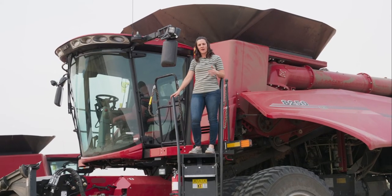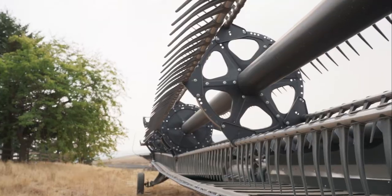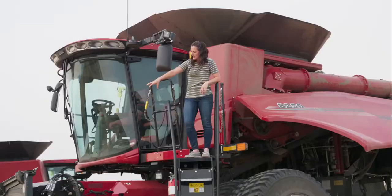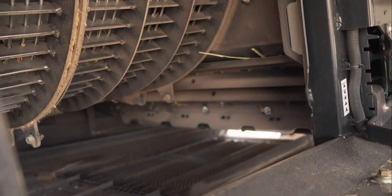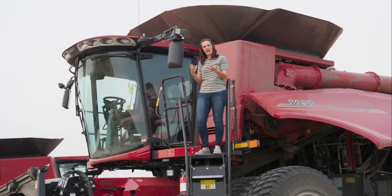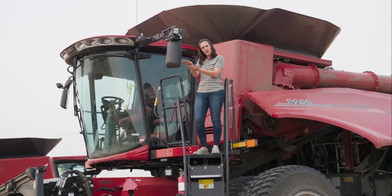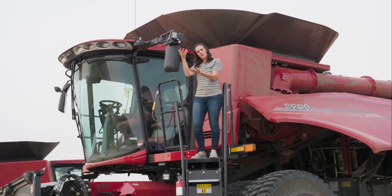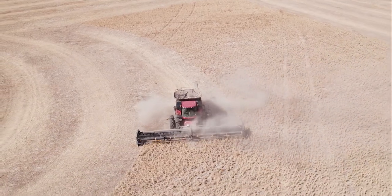This combine is what we use through harvest to harvest all the crops we grow. This is the main body of the combine, and then we have a very large 40-foot attachment that goes on the front. The crop feeds through this feeder housing and starts the threshing process — basically a giant barrel the crop goes into, equivalent to putting grain in your hand and crushing it to thresh and separate the grain from the chaff. It then goes through a cleaning process with sieves — basically shakers going back and forth — with wind coming from below. The wind blows out the chaff, the heavier grain falls through the sieves, gets carried up into a clean grain bulk tank, and that's what gets taken to market.